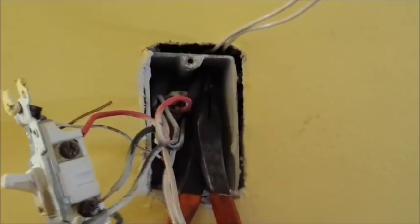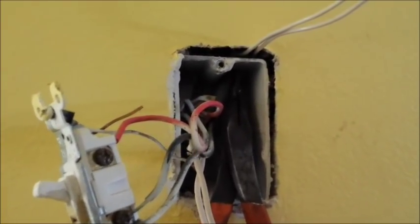After several attempts of trying to stab up there with the fish tape, I wasn't able to find the hole very well on the top plate. So I went ahead and reversed my process — went up in the attic and I pushed the fish tape down on top of the box, then I enlarged the hole there on the top of the box. I just took my drywall saw and sliced out about an eighth to three-sixteenths of an inch out of the drywall there — that'll get covered with the cover plate. I used this little scrap of white wire and hooked the end of the fish tape, guided it into the hole and grabbed it with my needle nose. I've got the end of the fish tape right there. So I'm going to pull my wire out and pull that fish tape down, then tape my three-wire onto it and pull it up into the attic and run it down into our new ceiling box.